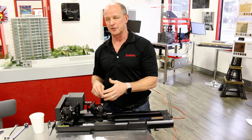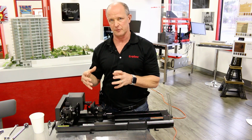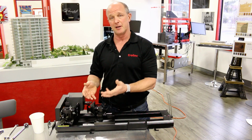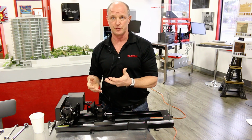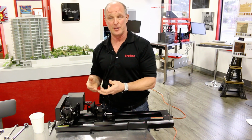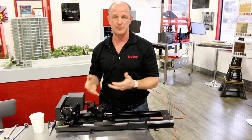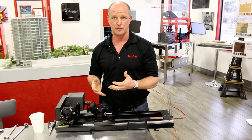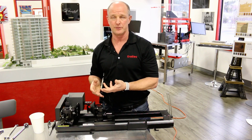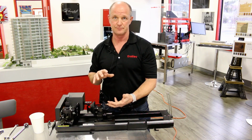The nice thing about having this adjustable though is that it gives you more ability to work with a larger diameter mug. Because as I raise this up, it gets closer to the lens, which then lowers the diameter that I can put in the rotary attachment itself. So it's a bit of a trade-off, but it does give me some ability to move back and forth, whether I want the handle to go all the way around. If I don't need the handle to go all the way around, I can lower it down and I get a larger diameter. Okay.